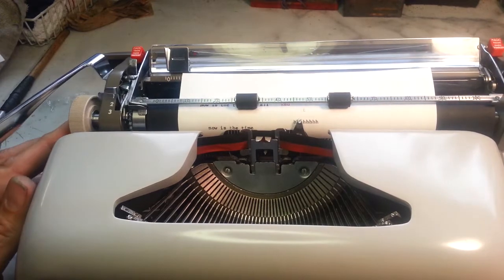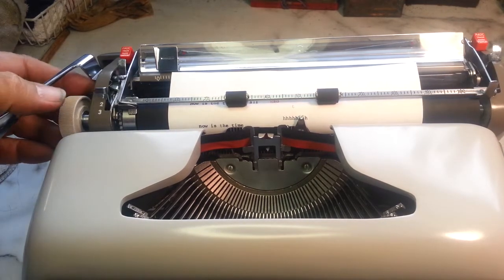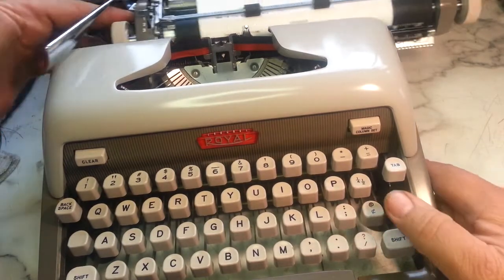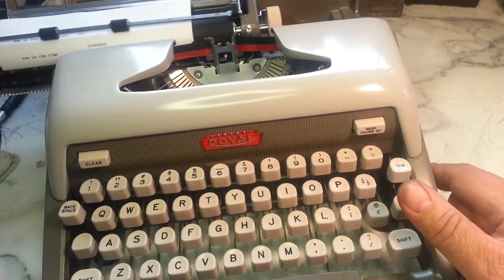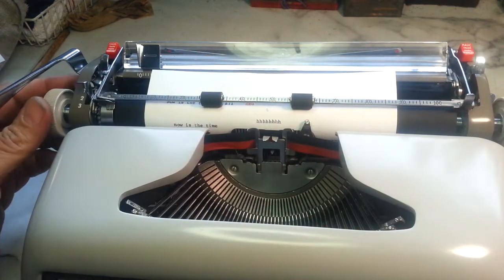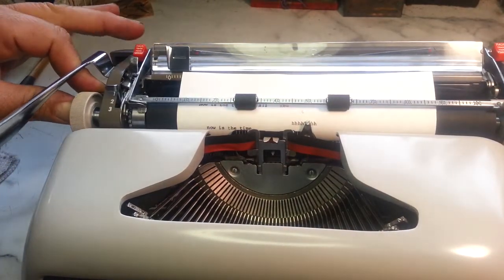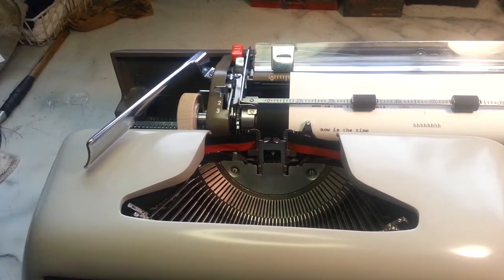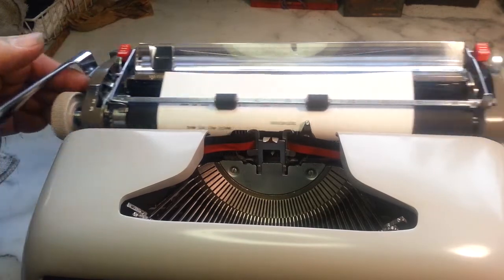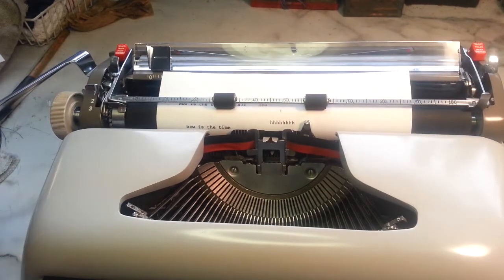Now the trouble is, inadvertently these buttons might get pressed, and you go to the typewriter and you can only move the carriage this far — and you're like, 'well what the heck?' You can hit margin release and move it further, but come back and it's still stuck, because your two margins are now here and here. So: release the carriage, butt up against it, push it down, move it to the edge, release it. Same thing with this side — push it down, move to the edge, release it. Now put the carriage where you want it, press the button, and it goes right there. That's how you do magic margins.